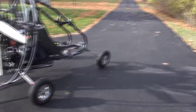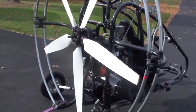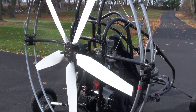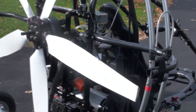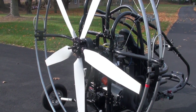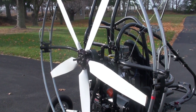Anyhow, we're set up here. I went ahead and changed the drive pulley on the Green Eagle. Before, I was pretty much at 2.0 to 1 — like 2.02 or so. I was getting some harmonics. So I went ahead and put — unfortunately, I wanted to put a larger drive pulley on, but that's the only drive pulley that Ashton Bruner has or makes. So I put on a smaller driven pulley.